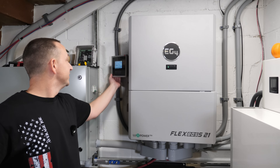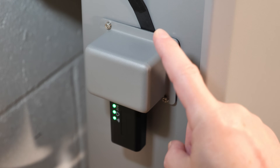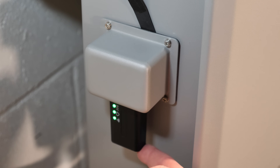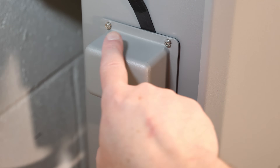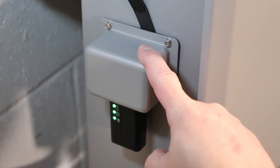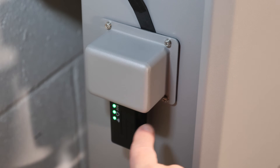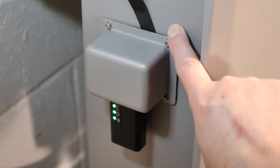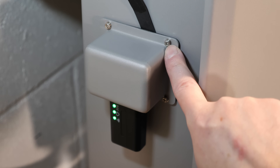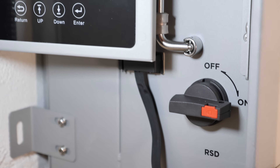I mounted the screen to the handle, so it can swing out on the side — the small box being the Wi-Fi dongle enclosure. I removed the Wi-Fi dongle, removed the four screws holding the box, and slipped the cable through the hole behind it. Steve's idea of adding a washer on each screw would space the box away from the inverter to give more room for the cable. I skipped the washers since the screws are quite long and I wasn't overtightening.